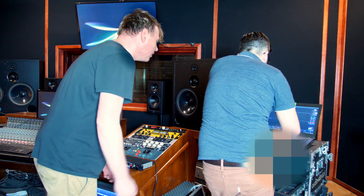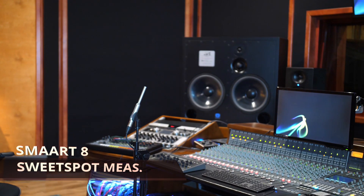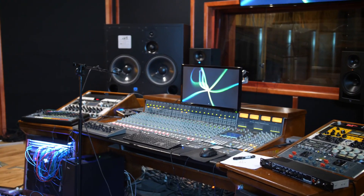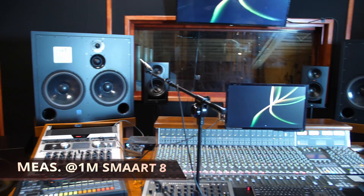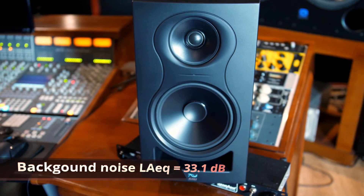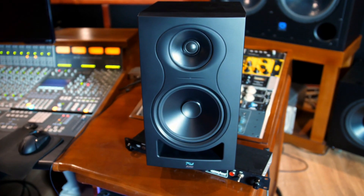It made us sweat, but the rig is almost ready. Michal makes some final adjustments to his setup and we'll be starting soon. Calibrating levels now. Okay, we are done at the sweet spot. Now we'll be measuring both sets from one meter. One more thing — right now we'll be measuring the background noise level, LA-EQ, to deal with a complaint I heard that IN8s generate a lot of self-noise. So we're going to check the background noise level with the IN8s off, and then with IN8s on, to see if that can actually be a problem.